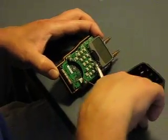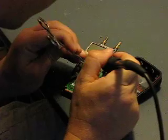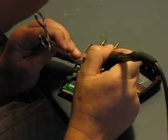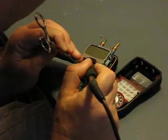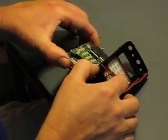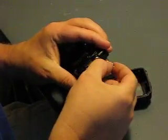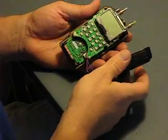In order to do that, I'll attach my little pair of pliers here and use this soldering iron very carefully. Heat up the pad, pull it off. There we go — you can see the jumper is removed. And that's it. Now it's modified for extended transmit-receive. Put it back together in reverse order, make sure you don't lose these springs, and that everything else goes back together the same way it came apart.